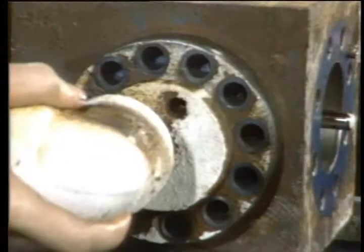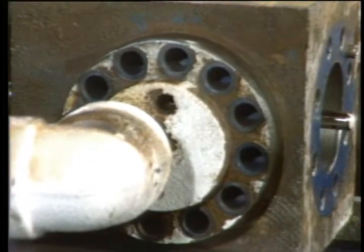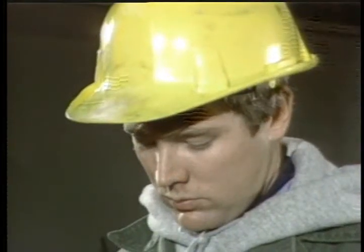Now you can start replacing the flanges. As you prepare to do this, clean and inspect the cap screws. Use your wire brush or the wire brush wheel on a bench grinder to clean the threads. Replace any damaged cap screws. Refer to your valve drawing for the part numbers.